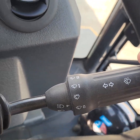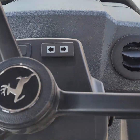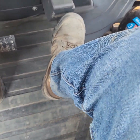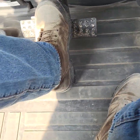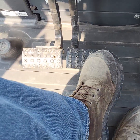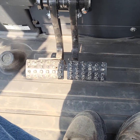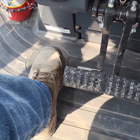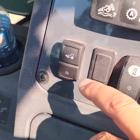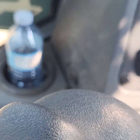On this side you have your turn signals — pulling it back is your right, pushing forward is your left — and you've got your wiper controls for the front. I can run this as a below-knee amputee, no problem, because it's got a big meaty pedal so I can run it with my artificial foot. That is your accelerator. These are your brakes — on backhoes you have a split brake: this is your left rear brake, this is your right rear brake, and that's handy when you want to steer sharp. If you're turning right, you can start feathering the right brake and the backhoe will almost pivot steer. That's your rear differential lock, and on the John Deere backhoes, the front axle on the four-wheel drive units is limited slip, engaged full-time with that switch up, or you can activate the button on the loader control for just short bursts of four-wheel drive.